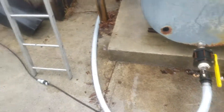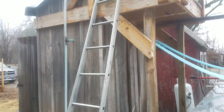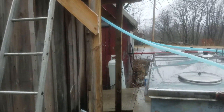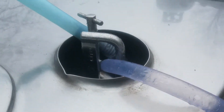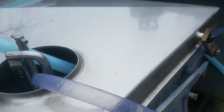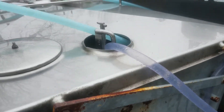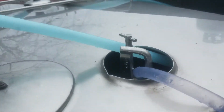This tank is taking it into the second RO, where it'll eventually end up up top to go into the sugar house, and coming back into this tank until we need it. So it's going from one and a half, through there to three, into there, back out at roughly six percent.